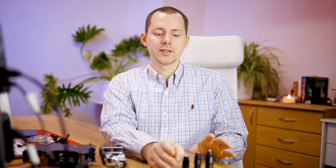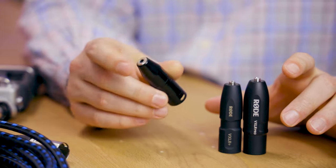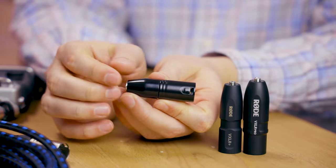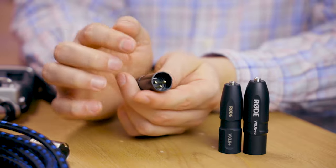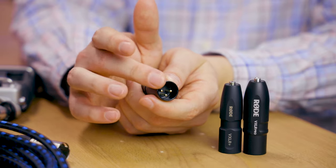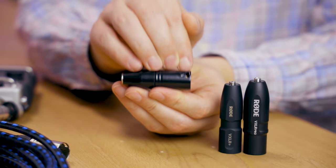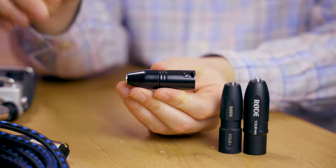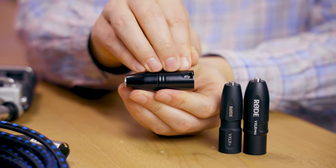The first major difference is something that both the Pro and the Plus have in common that the Rode VXLR does not: the conversion of phantom power to plug-in power. The Rode VXLR — the cheapest of the three — is simply an adapter which takes whatever you put on here and just makes a wire swap to get the signal to the outside of those three pins. There are no electronics whatsoever inside the Rode VXLR; it simply takes the wires from one type to the other.